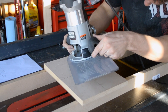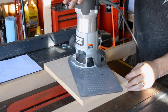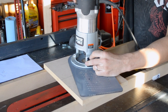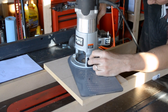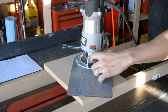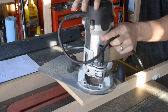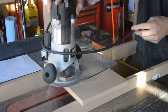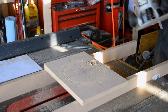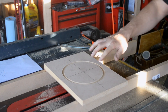For this piece, all I want to do is go down approximately one eighth of an inch. Some people like to start with the router all the way down; I like to start it and then put the router down to where I need it. Now that's completely done — we can blow it out. See our perfect circle, one eighth of an inch down.